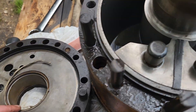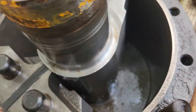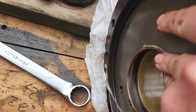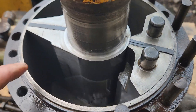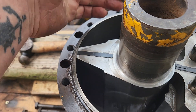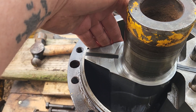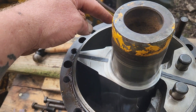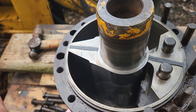You can see this is the seal that busted. Looking down in here, it has identical seals on the bottom as well. On the lid you've got an outer seal and then the inner seal. This inner seal basically takes up the space so you can't get a pressure loss — the pressure builds up on one side and pushes against this vane, and that's what makes your boom swing left or right.